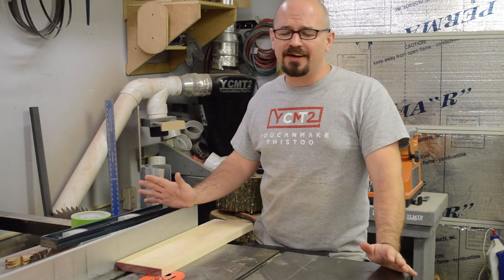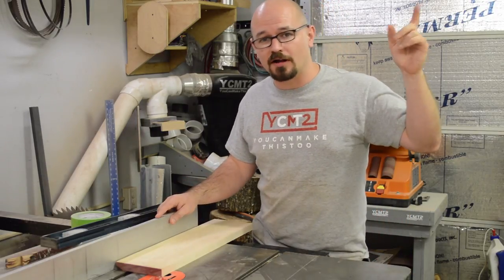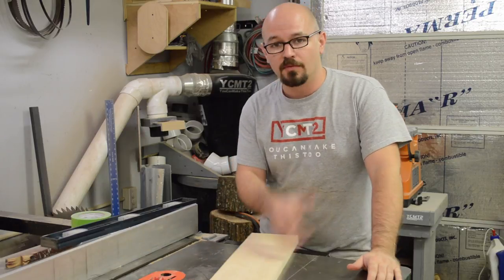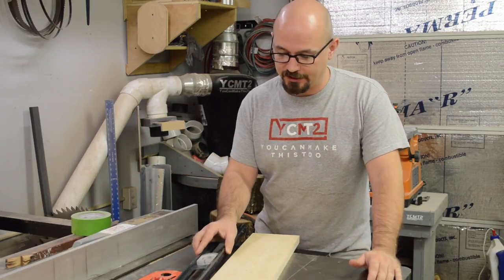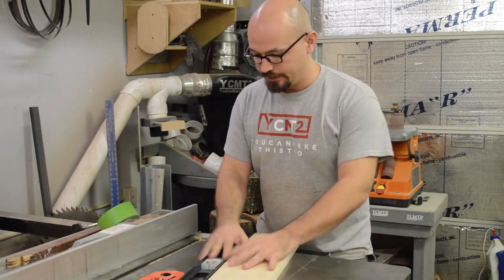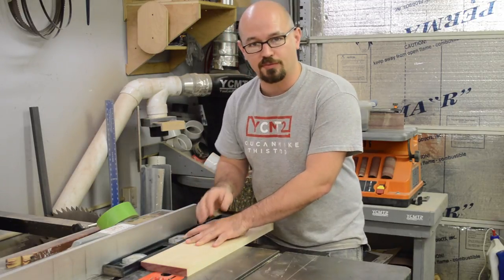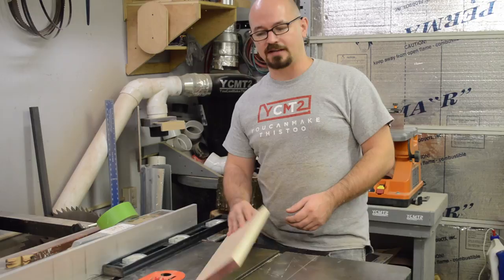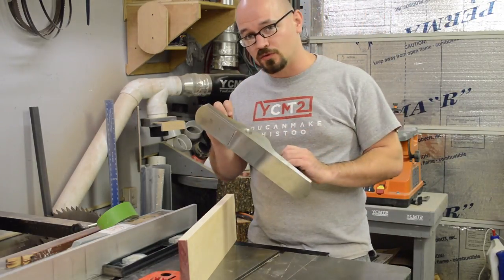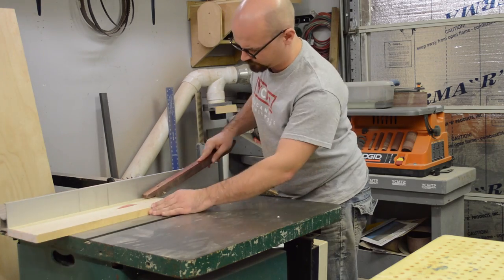I don't have a 120-year-old 12-inch jointer — I know. I'll leave a card to the story about the jointer if you're curious. There are lots of other ways to get a straight edge. Before I had that jointer, one trick I used was to take a level, tape it to your wood, and use your level against your fence as a reference to get a perfectly straight edge. You can also search for jointer sleds to make for a table saw, or just use a hand plane.